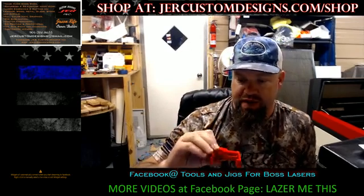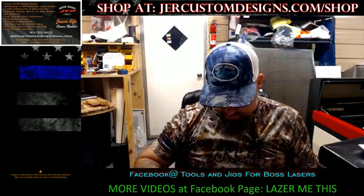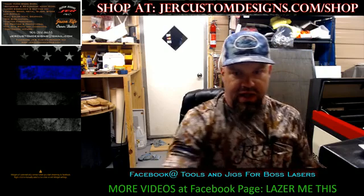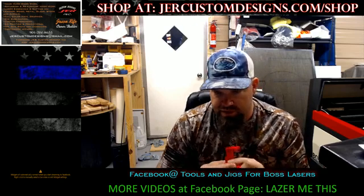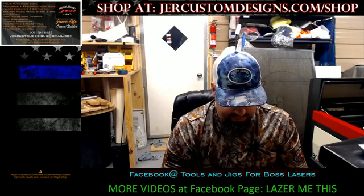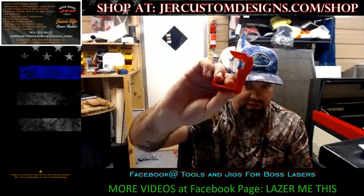A couple of people, or one person, had that issue, and so now it's been addressed, and these have come out. So now you have about 3.7 millimeters above the bed, and that should be sufficient to clear any nozzle in any configuration when you're running your laser. That way you don't have to worry about these being in the way when you go to home. These will take the place of the bigger ones and lower the clearance so you don't have to worry about it hitting. So those are the two major differences between the old version and the new version when it comes to the clamps themselves. Just the size difference in general.